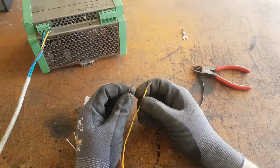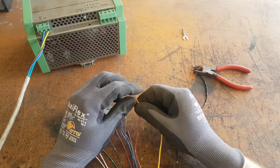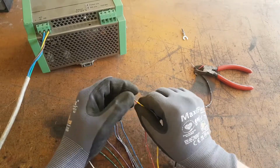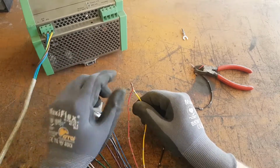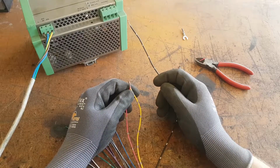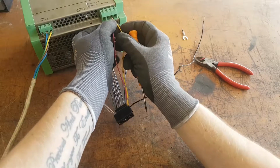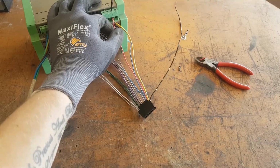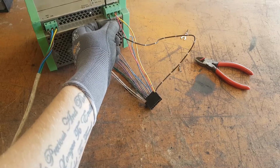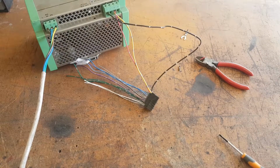So, as the radio requires the accessories to be on to power up, I'm going to join these two together, because I don't have an ignition and or accessories, so it's just going to have constant power. As soon as the power point is switched on, the radio will be powered up. Unfortunately, it does mean that if I program the radio, as soon as it's powered down, the memory will be lost immediately. Theoretically. So I think when I plug this in, I'll have constant power to both of these. Should be grounded. I'm going to go plug it in and see if it sets itself on fire.